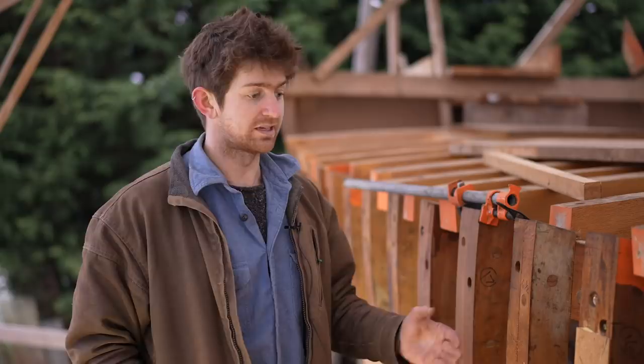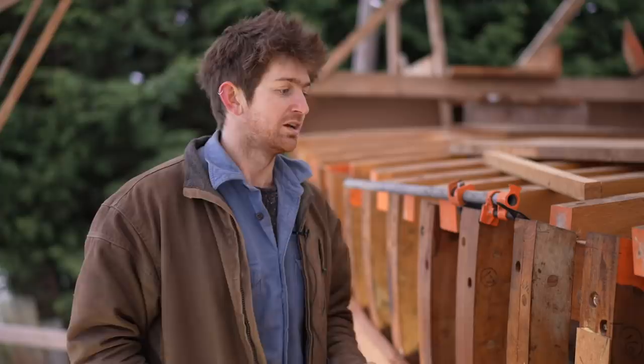So if you imagine one huge 12 inch plank, and say this particular timber in these conditions is going to expand and contract by half an inch per 12 inches. Now, that is a huge gap for one caulking seam to take. If you had four planks over those 12 inches of only 3 inches each, then you would have four caulking seams to take that half an inch of expansion and contraction. So each caulking seam would only be taking an eighth of an inch, which of course is much more manageable. Now, all those numbers are exaggerated just to make the point, but hopefully that illustrates what I'm talking about.